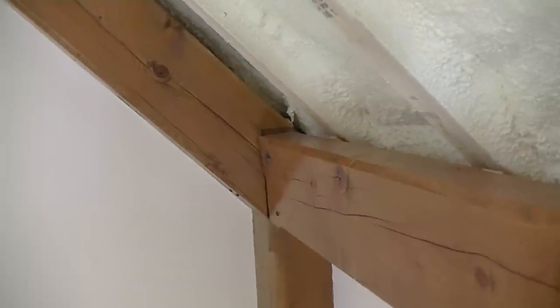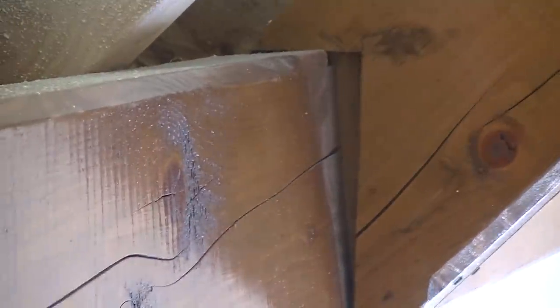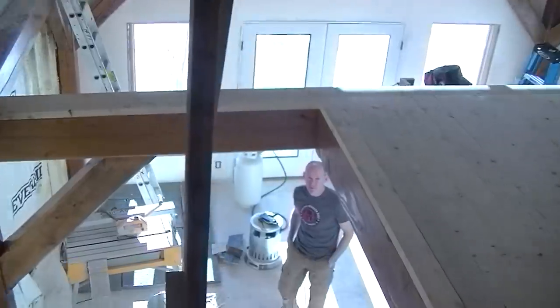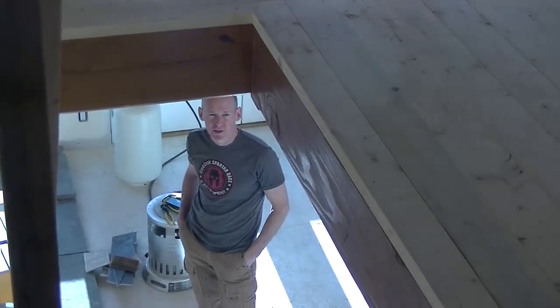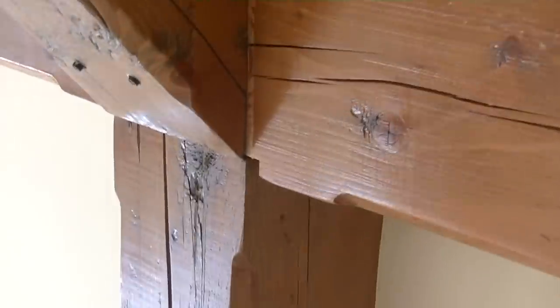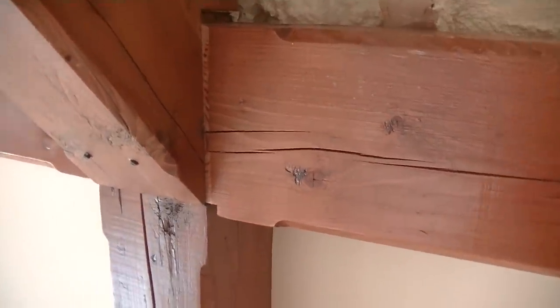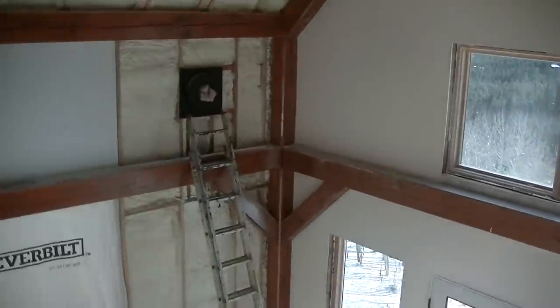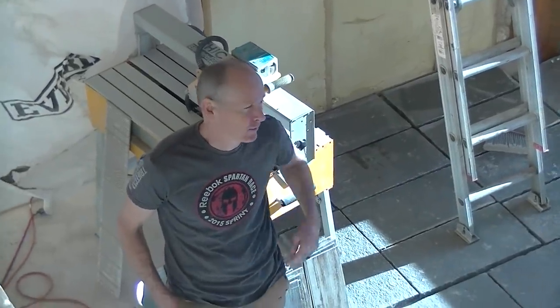That gap is hiding in the back corner of the loft. The beam is twisted — you can see it from this angle. The worst were the floor ones, probably because they sat there more. This one's got a little gap up here too — I had to compensate and kind of square it off on the top. But for first time timber frame, it actually went together pretty well. Amazingly well.